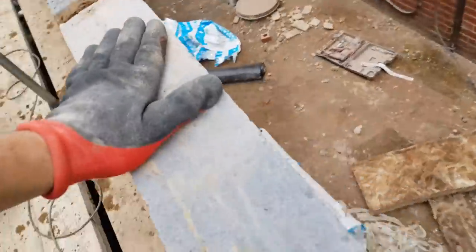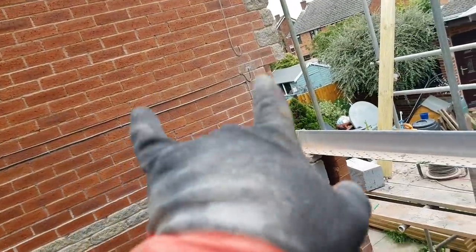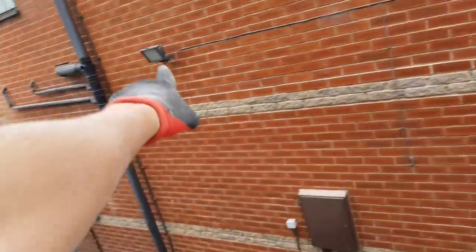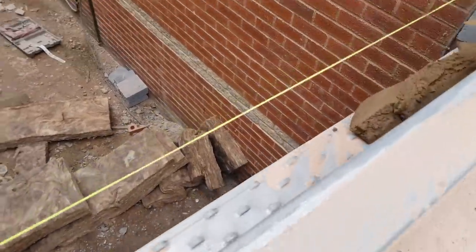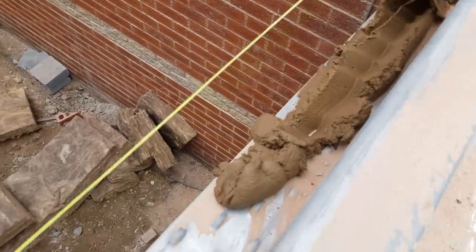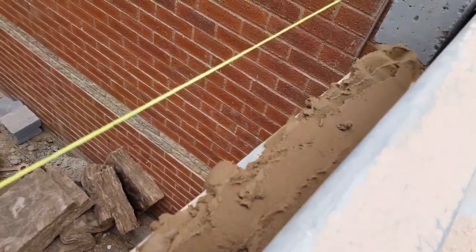All I need to do is a 140 cut and a full block over there, and the same goes to the front. Those wondering why I didn't set a datum up over there from the floor level — the knock-through is just a door, 930 knock-through right there. So as long as that is perfectly flush with their floor level, if this runs up or down 10-15mm even though it says level with the 6-foot level, it's not an issue — 10-15mm between friends, you know what I mean. So just about to run over this lintel and it's really important — anyone who is a bit new to brick laying: when you run over a lintel, especially one like this, you really need to pull your bed well away from the back of the lintel. See how it's really pulled away from the back of the lintel? Otherwise if it's pushing up here when you lay your block it will just tilt and lean over.